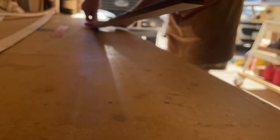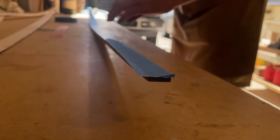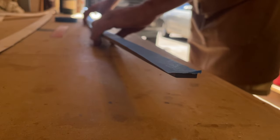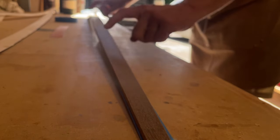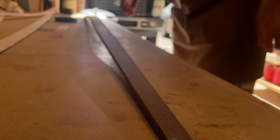I just have blue tape here - painter's tape - and I'm taping the belly side piece. The other thing this helps you do is in the heat of the moment when you're gluing, because when you're new at doing this, there's a little bit of panic that sets in when parts don't start going together as well as you had hoped. Things start sliding around and you're putting glue on every surface. Don't put it on the blue-taped surface. You've already figured out ahead of the glue up which side gets the glue and which side does not, so it helps in that regard as well.